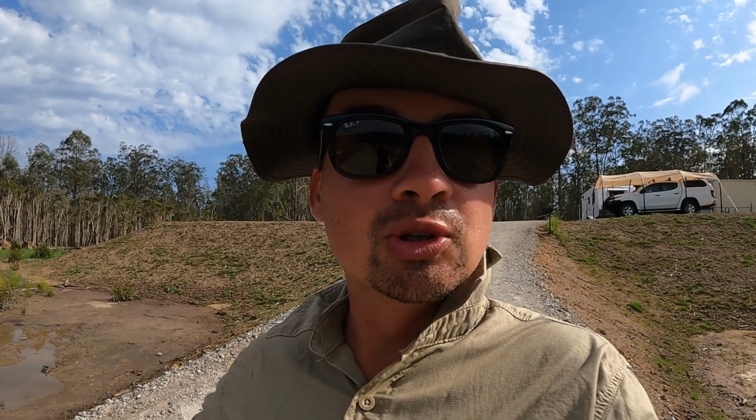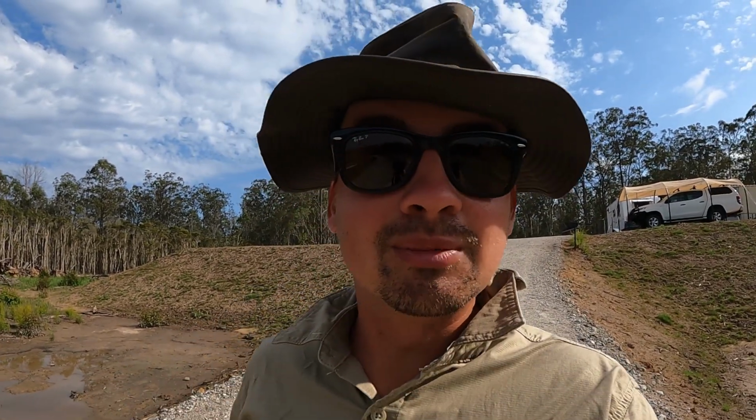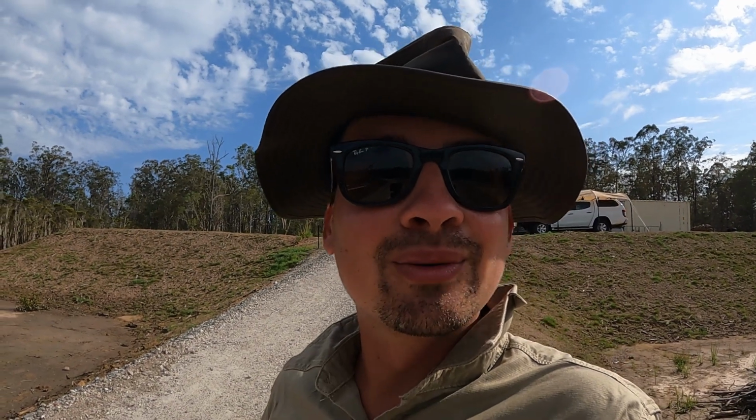Obviously in the long term there's going to be drainage set up and this problem won't be a problem anymore, but it was pretty cool to see that a siphon can actually be set up to span, I think it's 70 meters here from the puddle, the furthest puddle from the dam. So that's really cool. And we had it running day and night, basically didn't have to look over it like we would with a pump. And the next thing we knew, the area was dry. So both sides took 48 hours each to drain though. So it is pretty timely.